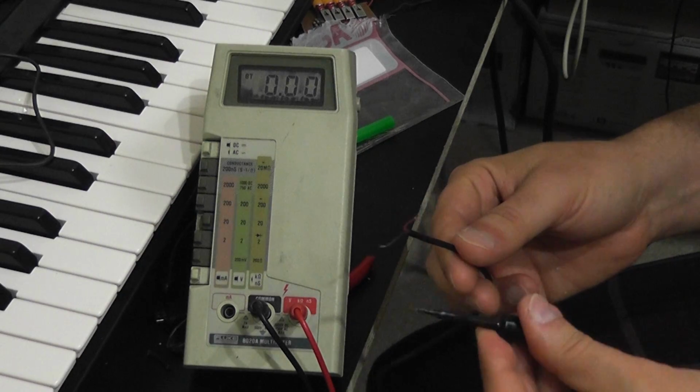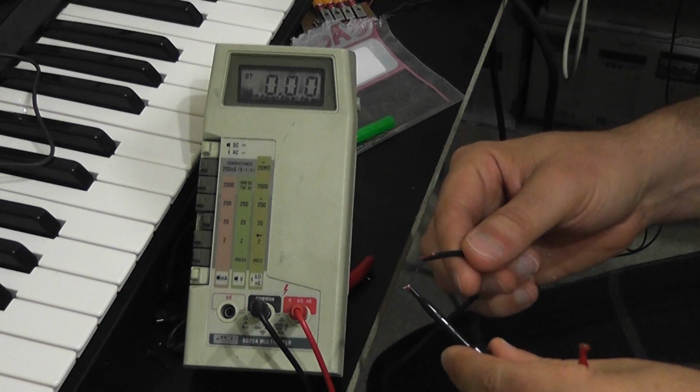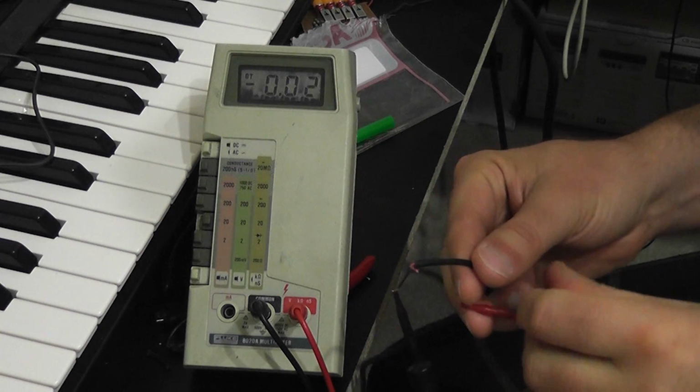There we go. Oh, look at that. Two wires. How handy. Well, there had to have been at least two in there, but they haven't done it like the audio wires. They've actually run two separate wires, a black and a red. I'm guessing red's probably going to be positive, and the black is probably going to be our ground. So I'll strip the ends off, we'll stick a voltmeter on there, and we'll find out for sure. Off of each end. There we go. So let's see what happens. Okay, we're going to make an assumption here that black is negative and red is positive.